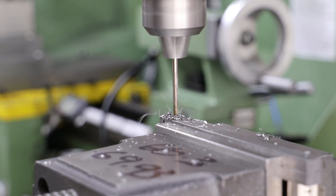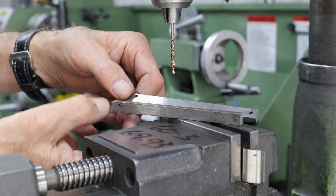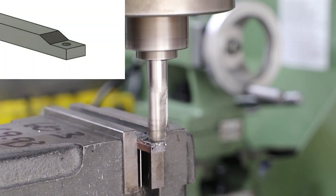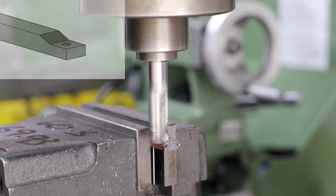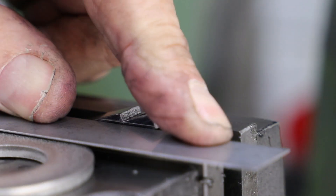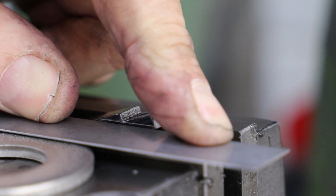I can drill them both together from one side of the pair of bars. Now I move on to cutting the profile at the cylinder end, and I use an end mill to bring down the thickness of the slide bar from 6.35 millimeters down to four. To cut the angle, I reposition the slide bar in the machine vise and use a ruler to both help me position it correctly.